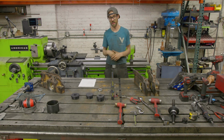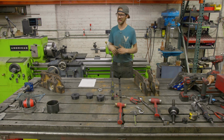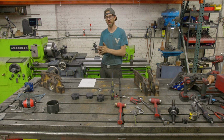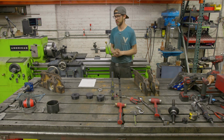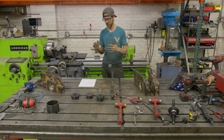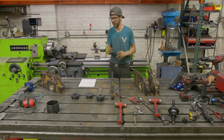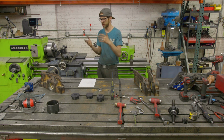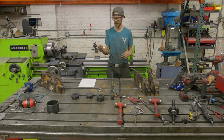But like with a lot of things, there's a lot that you see that you don't think about, and it's a lot more difficult than it can be. What I would like you guys to understand is that when line boring is going well, it's not too bad. But I think the difficult part, and this is from limited experience on a couple different types of line boring so far, is the issues that really throw you off. When you're having problems with your welder not welding or porosity, you spend a lot of time fighting whether it's the tooling or the setup or other details, or maybe you overcut it and then you've got to redo it.